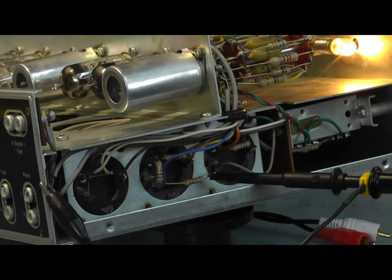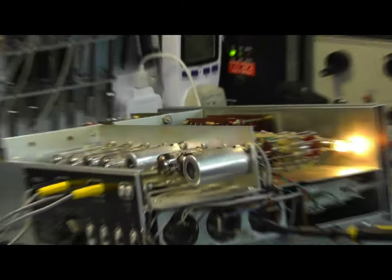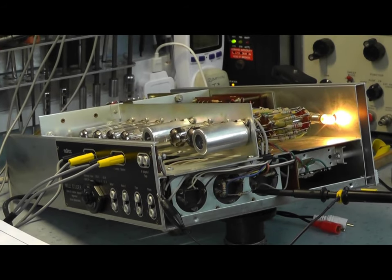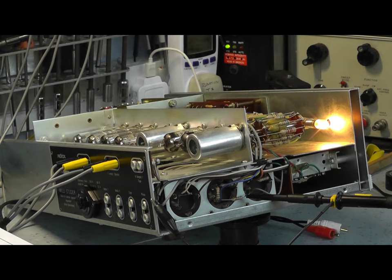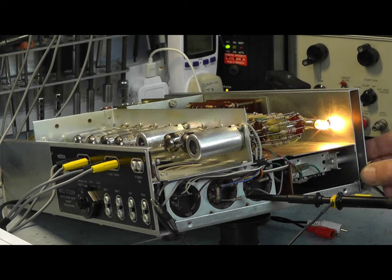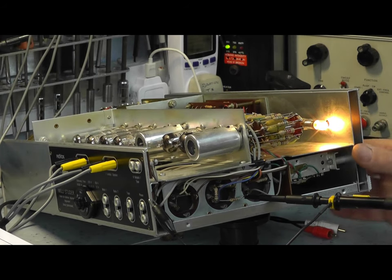So it basically looks like the power supply section is okay. The coupling capacitors on the top end are fine. It looks like the whole amplifier is really okay to be run through the analyzer now. Have a listen to it with some speakers just to make sure there's no noise or anything. I tried it last night and it sounded fine. So let's get it all connected up and get it onto the audio analyzer. If I can turn it off.